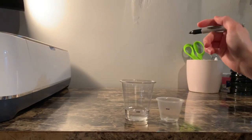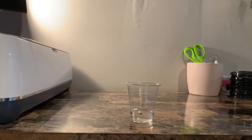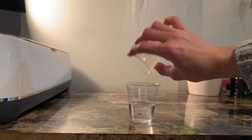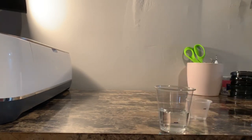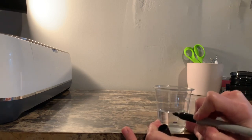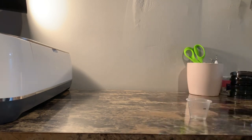Once you have your Part A line marked, leave the water in your mixing cup and go get the same amount of water again into your measuring cup — we have 20 more mils. Pour that into the mixing cup, bring it to the edge of the table, and mark that spot at the water line. That's where you'll aim for your Part B epoxy.